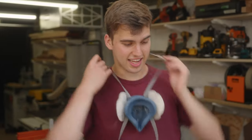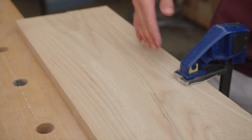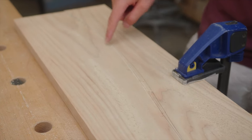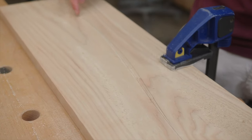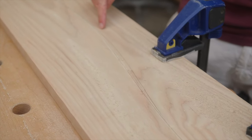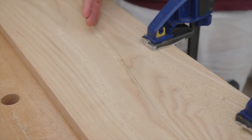It's very important not to follow the curve too rigidly. If you stay exactly on the line it's very easy to go off, and if you did go off you'd want to go back on the line immediately — then you would have too tight of a radius that the veneer won't fit to. So if you notice the saw slightly drifting off course, keep that going and then slowly bring it back on track. If you immediately bring it back it's going to be too tight and when you glue the boards back together you're going to have a gap.